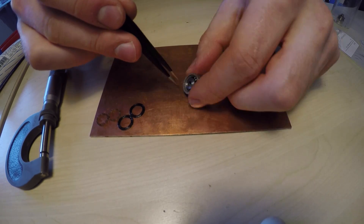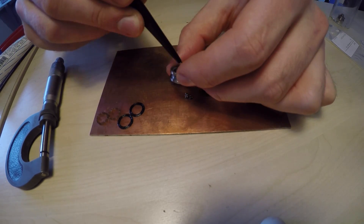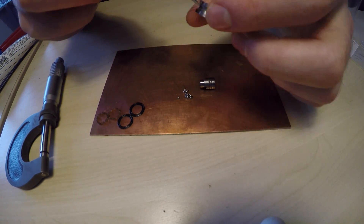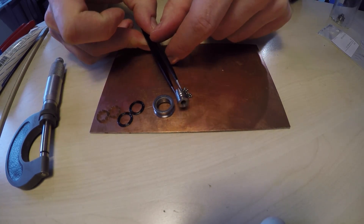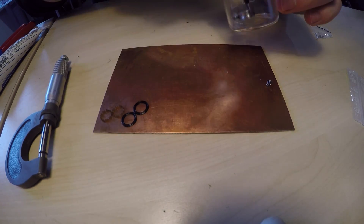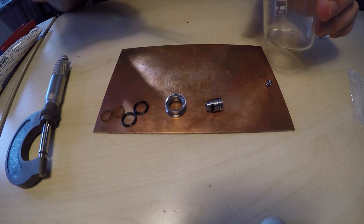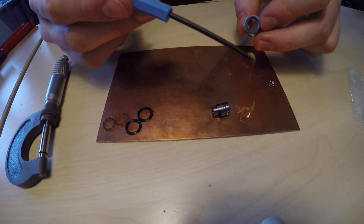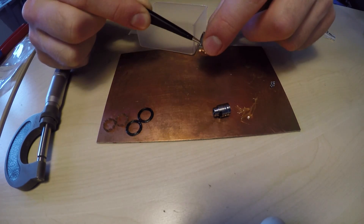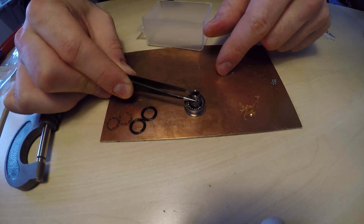These have two rows of nine ball bearings each, so very nice parts, but difficult or even impossible to get. This time I tried the correct 1/16th inch roller bearings, which fit very well, but sadly the other parts were damaged as well, so the ride was still very bumpy.